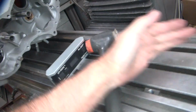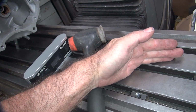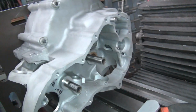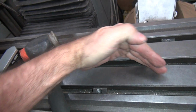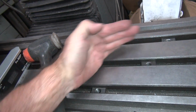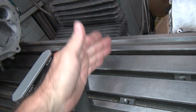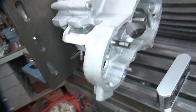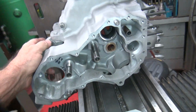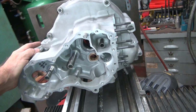It's 25 on that one, so it's only 20 on this one. 22.5 forward, so that's like it's offset to the rear a little bit, which makes it even worse than the clearance in the rear head. Or is it the other way around? Let me see. No, it'll be the other way around. It's got more angle in the front, less on the back, so it's tilted. It's leaned forward to give you more exhaust clearance to the frame. But I don't know if that is how it's supposed to be or not, because there's no reference. So right now, that's what we're looking at.